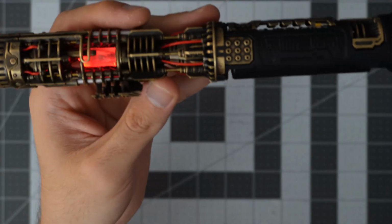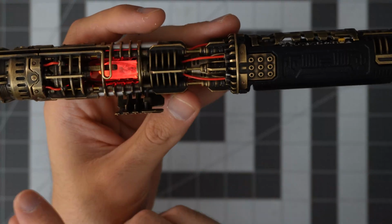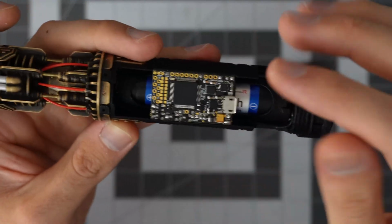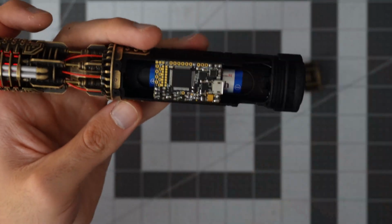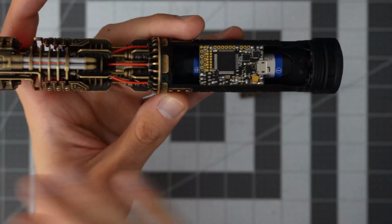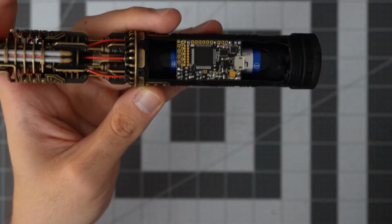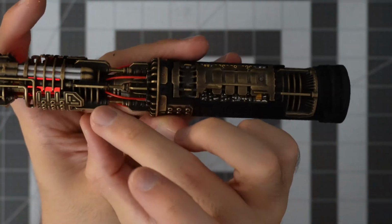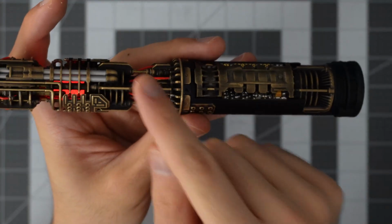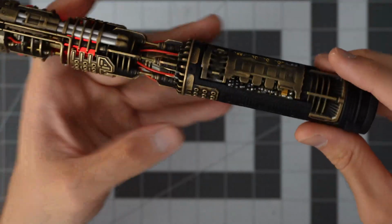for me to set up, because I want all of the accent strips set up on the same data line, because with how Crystal Focus is set up, you've got the main data, and then you've got the data 2, which is the LS2 right there. So I wanted all of the accent strips on the LS2, so I needed a data in and a data out on the crystal, so I replaced it with just a standard NeoPixel that I had with a data in and a data out. And it's pretty much what I did with the Ray Master Chassis as well. It just works a lot better for how I set up the pixel strip.